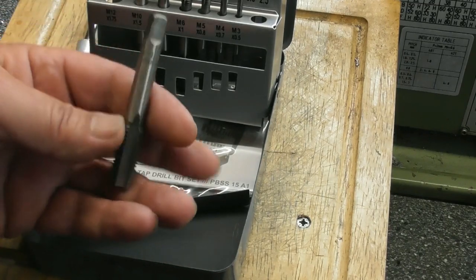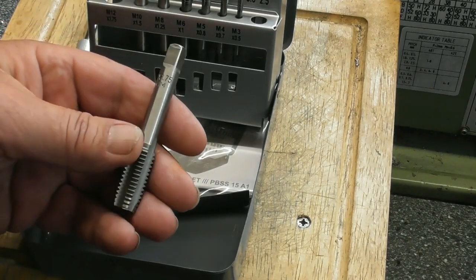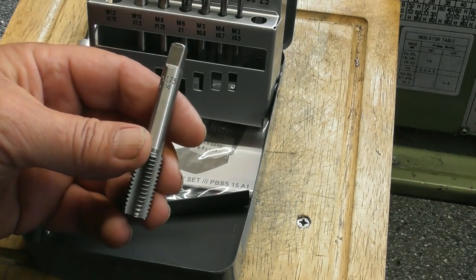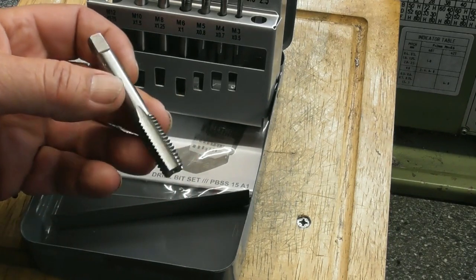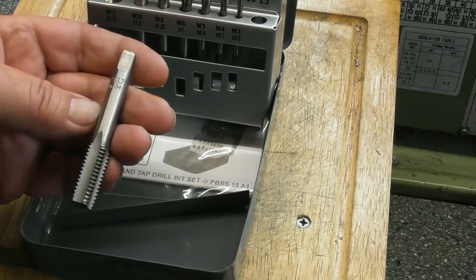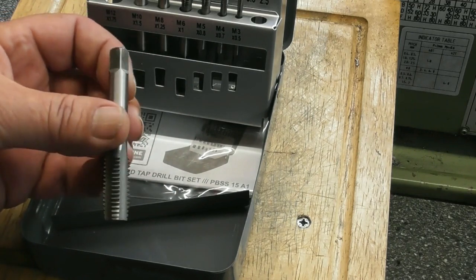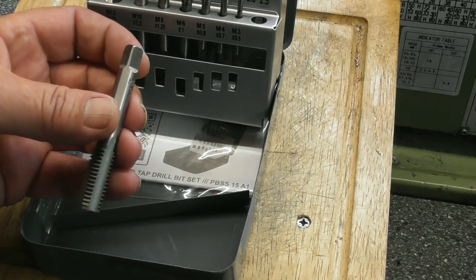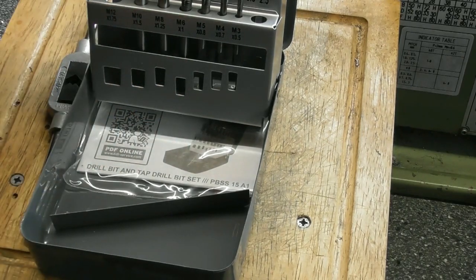If I pull out the M12 tap, it doesn't actually say high-speed steel. M12 by 1.75, OWIM. I think these could be high carbon. Alright for chasing a thread out, but not much good if you were power tapping, anything like that, I wouldn't have thought. We'll give them a try out.